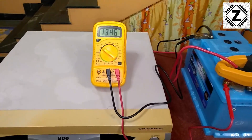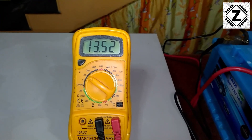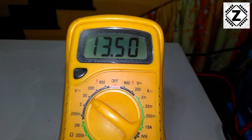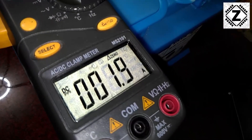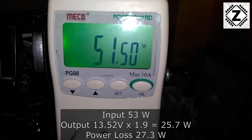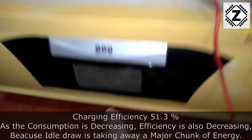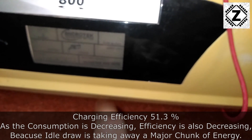The inverter has achieved 13.5 volts — the reading is 13.53V. The fifth point on the display is now flickering, so it's about time the battery hits float voltage. The amps being given to the battery have come down a lot — just 1.8 to 1.9 amps. To provide these 1.9 amps it's taking only around 50–59 watts from the grid. I'll wait for this to stabilize and give a complete reading once the battery hits float voltage.